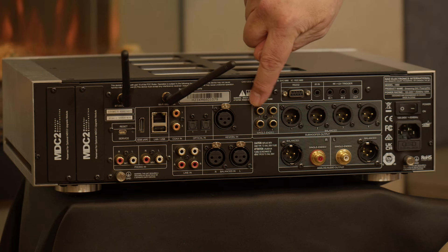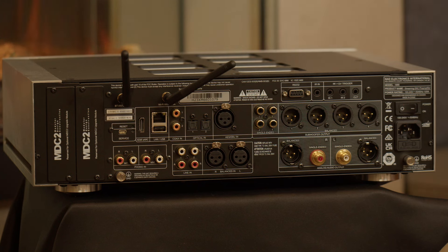One really interesting and unusual aspect is the four independent subwoofer outputs, both in XLR balanced and normal unbalanced RCA. Why would you want four subwoofer outputs on a stereo component? This is where the M66 breaks new ground, because the four subwoofer outputs allow you to get the absolute best bass in your listening environment. Room acoustics can wreak havoc with bass reproduction — frequencies can cancel or reinforce each other, and these room modes are unavoidable. Adding multiple subwoofers positioned carefully is the key to dealing with this.